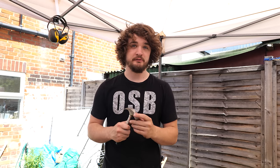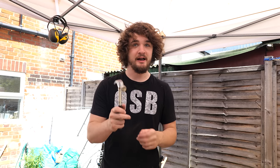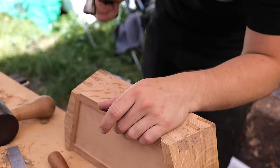And anything larger than 1 millimeter, you're probably going to want to resort to some solid blocks of wood. Wedge those in there, mushroom them out with the hammer, and then do the dust and glue technique on top of that, and you should be able to fill quite a lot of gaps. So there's three stages to it, and you can either start at the very end or you can start right at the beginning if things are really bad.